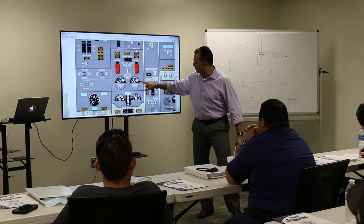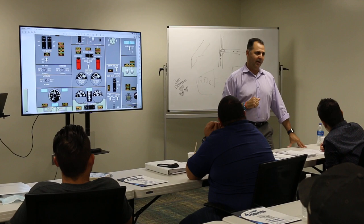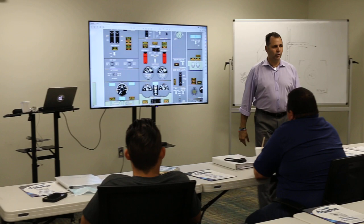So then you're going to check it in the top. The top says 0 to 30. The bottom goes all the way to 160. Rise — the difference between the oil temperature coming in and out of the CSD is going to tell you how hard the generator is working. On the in, you only check the temperature of the oil going into the CSD.